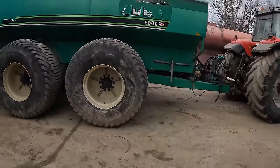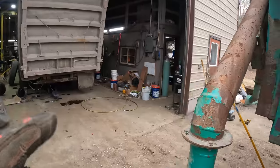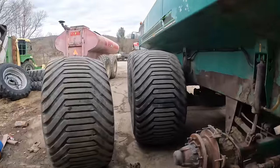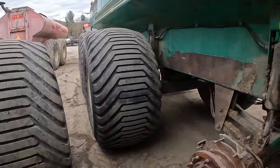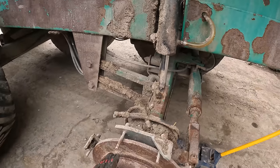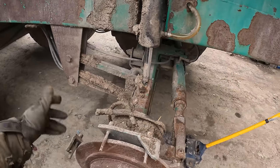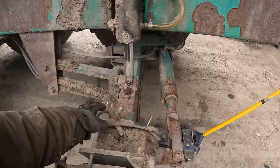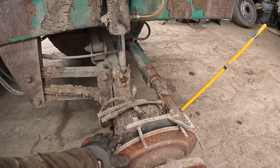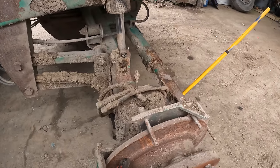So yeah, now I don't know how much Ferdy recorded earlier, but they went and grabbed my tank. My mom's still not back with the parts for that, and I got this tire off. They're all low on air, but I've got to do the brakes. Last year in the fall, this wheel, the brakes were sticking for a long time until I had a hydraulic line, or not hydraulic, brake line that was leaking. I fixed it, and then I saw that the brake calipers were stuck, and they weren't releasing, like they weren't returning all the way, so they rubbed themselves.